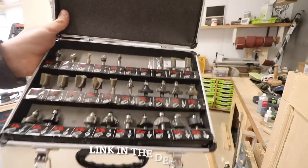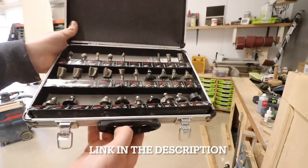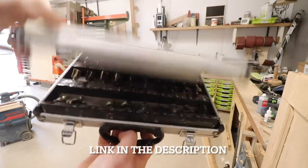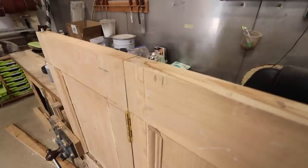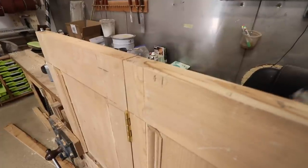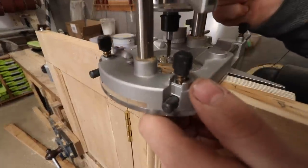But it's one of the narrow cutters here. It's actually a really good little set. I think it's only about 25 quid or something like that, so well worth having one if you've got a quarter inch router. But yeah, this is the 5mm diameter cutter, and it just works lovely for plunging in to cut this magnet hole.